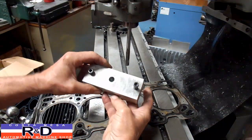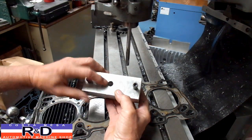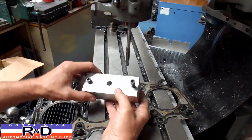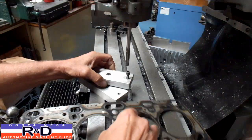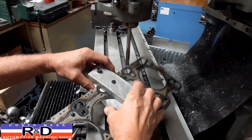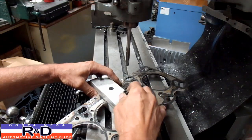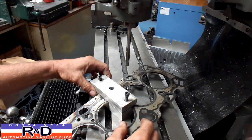So we're going to show you how this is done. The fixture is real simple — it's just a couple pieces of aluminum with a hole that's been reamed with our reamer. Now all we have to do is open this up, take our gasket, and set it in here, get the gasket lined up with the bolt holes, and then we just ream it out. I'm going to show you how that's done.